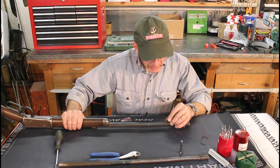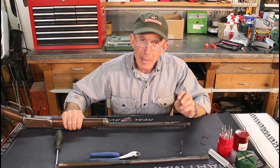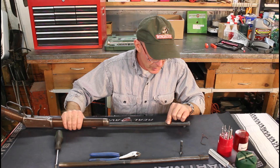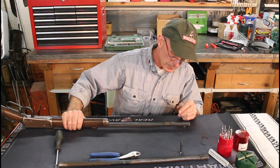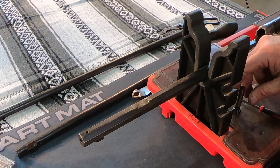What I think I'll do is just try to clean it out as much as necessary to get this in. If that doesn't work and it needs to all come out, the nice thing with solder is it has a very low melting point. We want to keep heat off the barrel, but we can always just take a propane torch and melt that out of the dovetail if we need to. But I'm just going to try with some little files first and see if I can get that cleaned up enough to make it work. If not, we'll melt it out of there.